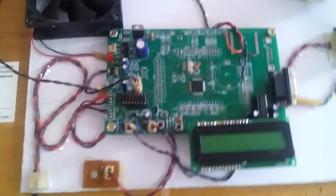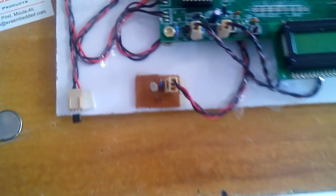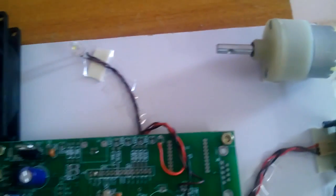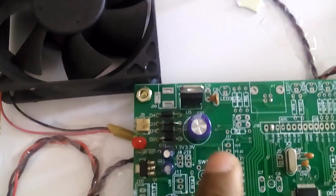For the hardware part, we used the LPC2148 SVS Embedded development board, one DC fan, one bulb, an LM35 temperature sensor, one LDR, and one PIR sensor. A DC motor is used to open and close the curtains based on LDR input. The power supply uses a 230V input step-down transformer with 9V AC output, connected to a bridge rectifier, filter capacitor, and 7805 voltage regulator.